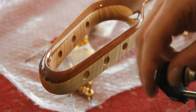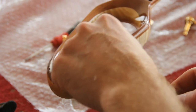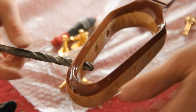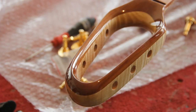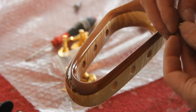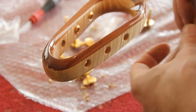Okay. Nicely. So I put some felt pads on there. They're sticky felt pads. And to protect the polish. And now I'm gonna do this for everyone. Also, I used this before I polished to take off the edge. So whenever I have to remove these, there's less chance of the wood ripping out. The last one.